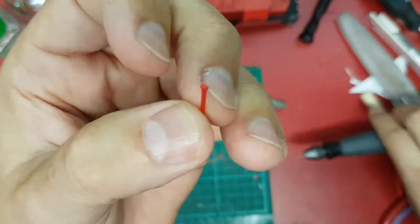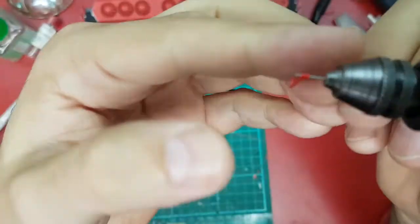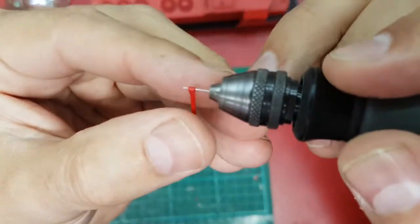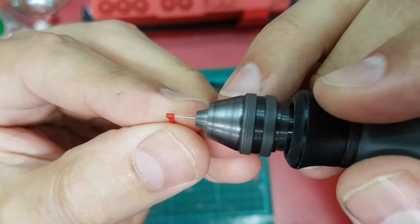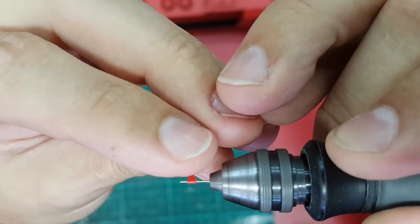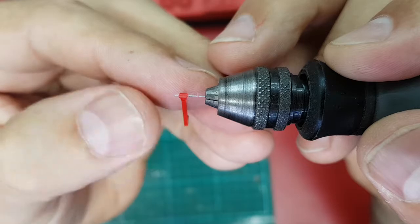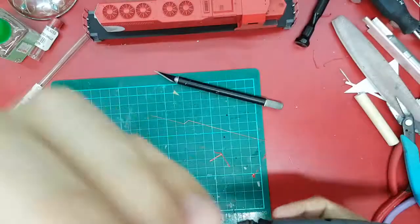All right, so we have a stanchion that's drilled through, but before we can use it, I want to make sure it sits properly on the drill bit. Now, if you notice, it's angled out that way just a hair. So I'm going to turn that drill, and I'm going to work the bit until it's straight and level, and then also from the top, you want to make sure it goes through straight. Now that's hanging off my drill bit quite nicely.